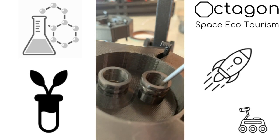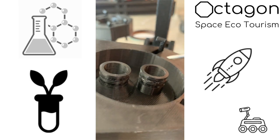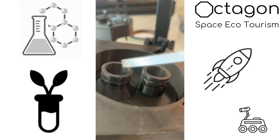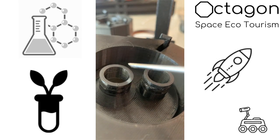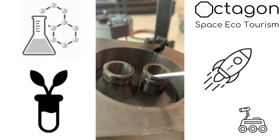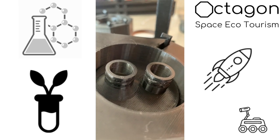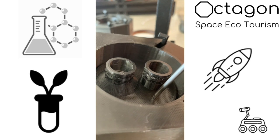So when the pump cylinder goes up, a spring is going to close this one, and then the pressure is going to release this ball, and then we're fine. The pressure is also going to close this one. The springs may not be required, but I believe the springs are the difference between a self-priming pump and a non-self-priming pump. More conversations on that maybe later on, but this is one of the reasons I wanted to do the first video. So again, this cavity in here is completely not required.